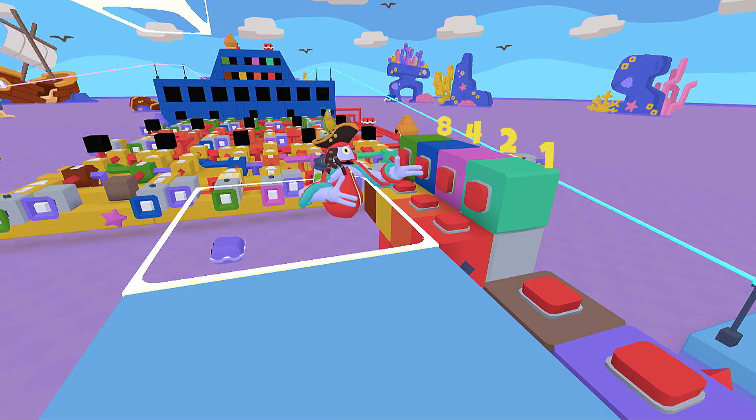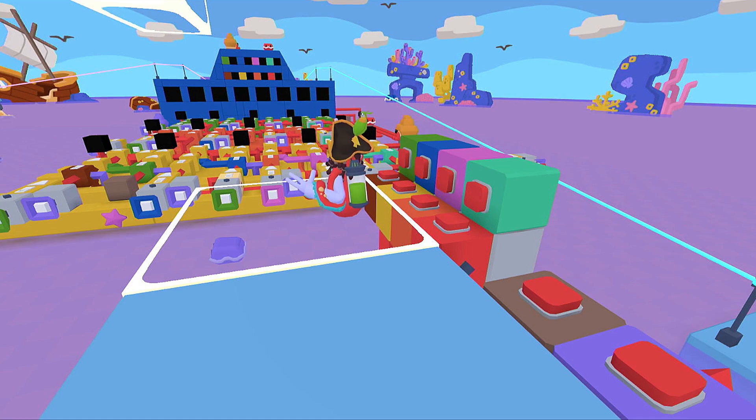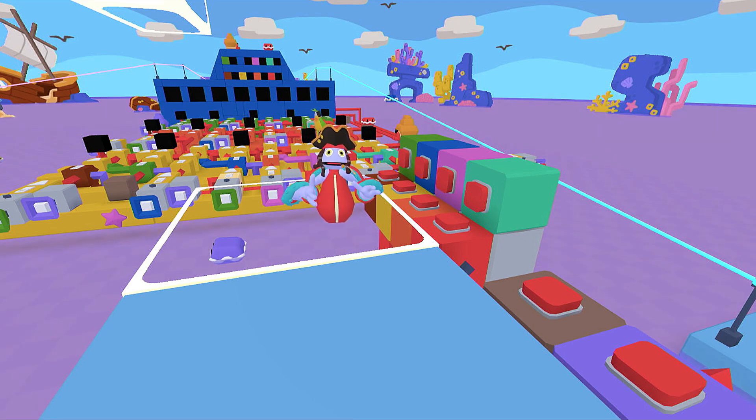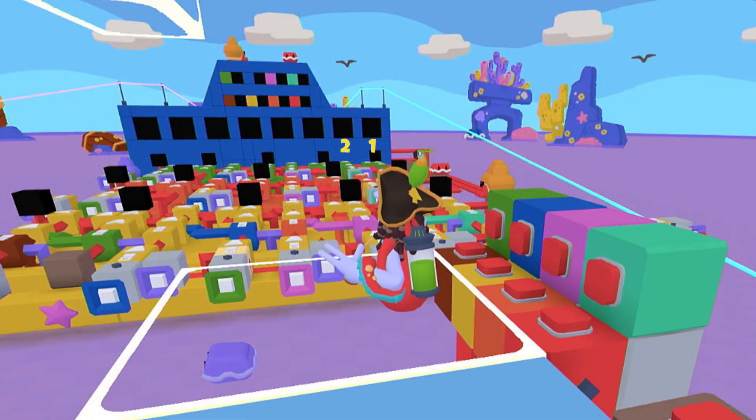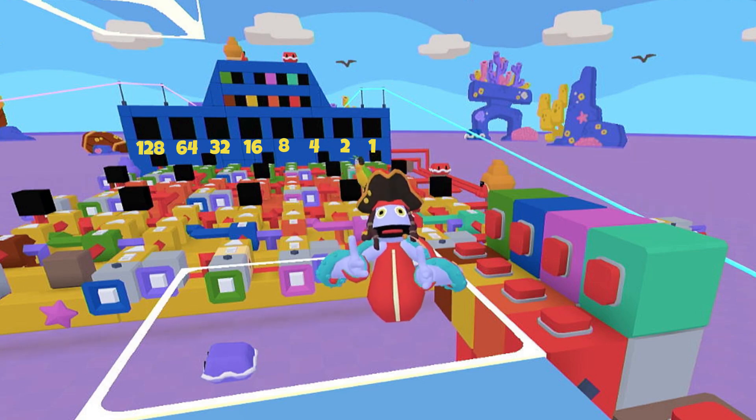The first row is my first set of binary numbers: 1, 2, 4, and 8, so the maximum number on that top row is 15. Those correspond to the top row on the machine, right next to the colors — I picked blue, same as the background. The bottom row is red, orange, yellow, and brown, reflected up on the machine too. When I press these buttons the screens light up showing the two numbers being multiplied in binary. The big row at the bottom with eight bits is the final sum, going from 1, 2, 4, 8, 16, 32, 64, up to 128.